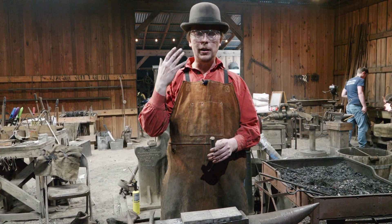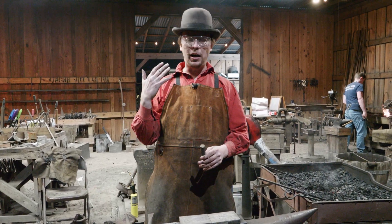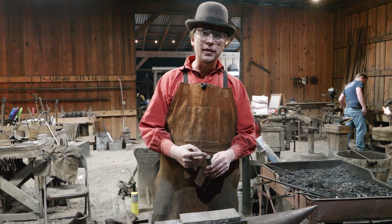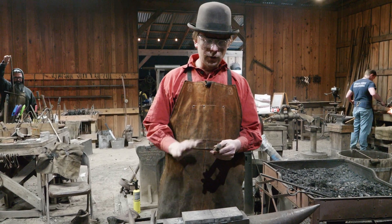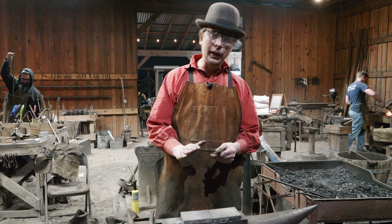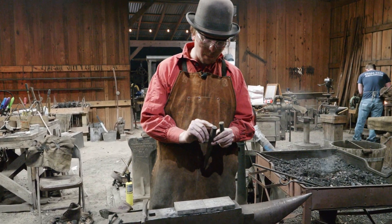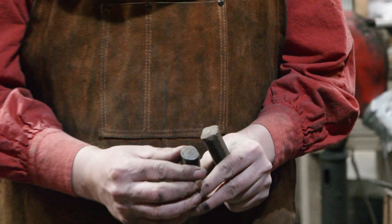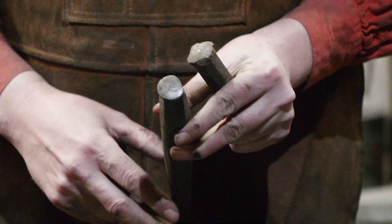If you're not wearing your eye protection, not wearing your apron, you're blacksmithing with no shirt on, hitting hard steel to hard steel — that could be a real risk. So keep things safe. Clean it up anytime you start getting really even to this level. This one needs to go back — we're starting to see some cracks right in there. Need to clean this up.